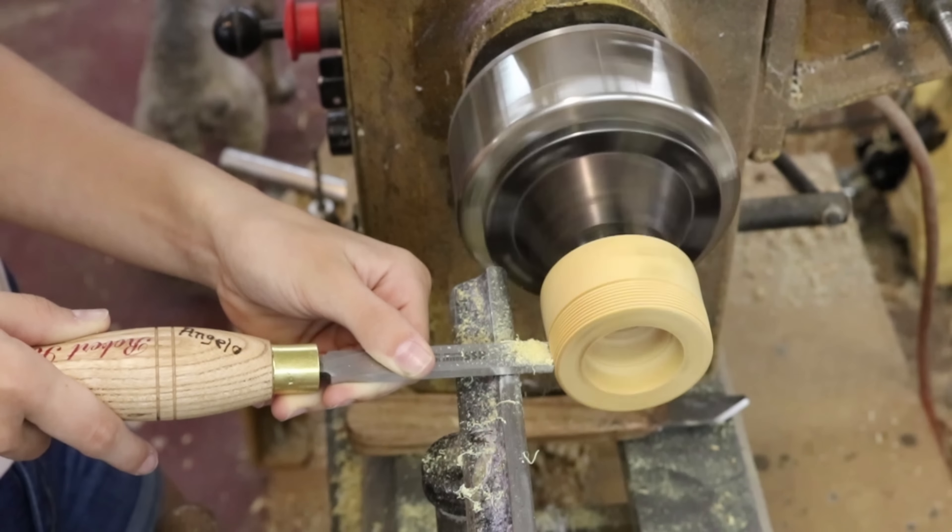Keep in mind this was just a simple technique to help you start chasing threads. Sophia and Eva have done a little bit of turning, but they haven't done enough to actually make something like a box — that takes a pretty good skill level. So if you're thread chasing and you want to do a threaded box, you need to make a box with a slip fit. All we've done is just a little bit of how to chase a male and a female thread and an approach that you can practice doing that. These guys have got a long way to go to make something more advanced like a box, but that gives you an idea how to get started. Girls, thank you very much — this is Eva and this is Sophia. And here's a shout out to the other one in Las Vegas — Grace, we wish you could be here.